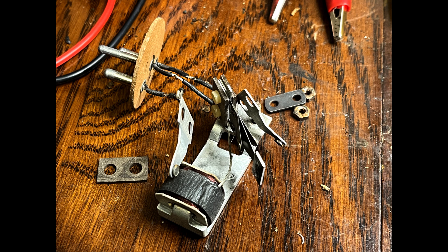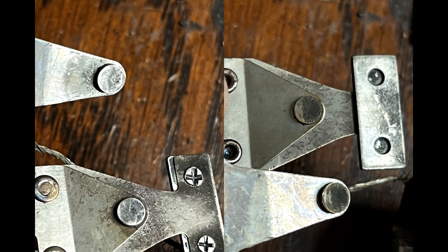The main thing is to just take this apart — on this one there are two nuts and the pieces are sandwiched together, so they come apart easily and you don't have to take apart more than you need to. You don't have to desolder anything. You just want to clean up the contacts nice and good. I have a before-and-after here — actually it's cleaning one pair of contacts and then showing the other pair uncleaned. It doesn't have to be perfect because the contacts only touch in one place, so as long as you clean off the high spots, you're probably good to go.